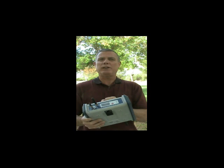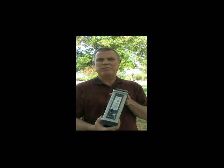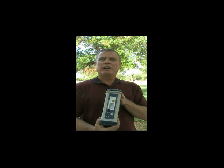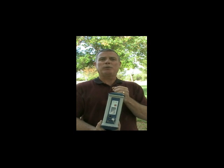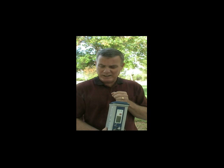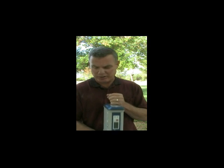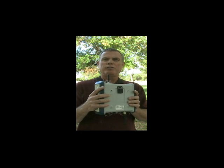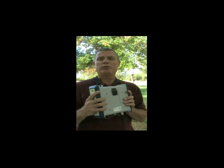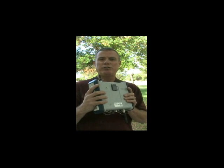Inside the box is an embedded web server. This GNSS receiver can be viewed, configured, and managed from the internet — one of the more powerful features if you're going to use this as a remote base station. Within that web server, there's an embedded NTRIP server, so you can virtually hook it into any RTN real-time network and go right to work. We support all the industry standards: RTCM and NMEA standards. It can be manually or automatically configured with an IP address — DHCP. I also have the ability to do event markers and PPS, pulse per second. In an orthophotogrammetry setting, for example, the camera is triggered by a pulse per second from a box like this, and that event is recorded back into internal memory through the event marker — this GNSS receiver supports both of those options.